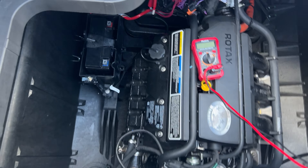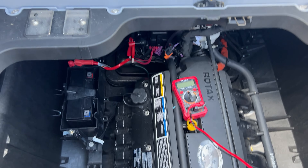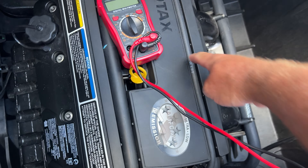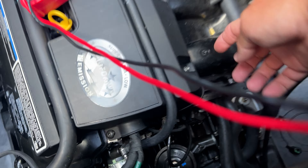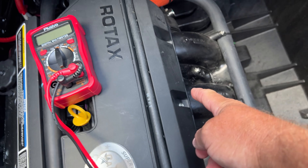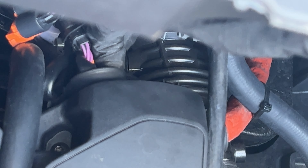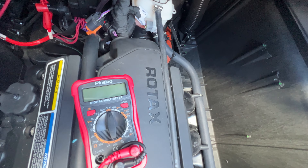The boat will get a battery warning light the first few hours. The reason is this plastic engine cover right here, this one piece. So you have a torx bolt there, a torx bolt in the back, and three little nuts here. The problem with these is this front one — as you see the wiring harnesses coming out here — that front nut, the torx bolt that they're pushing through, is pinching the stator wires.